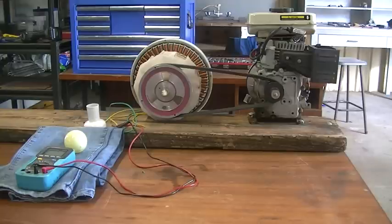This is what I've put together so far. I've just took the motor and the generator up and doing a little bit of load testing. That light bulb is only a 60 watt bulb, and we can also have a look at the voltage we're getting from our generator while it's running. At the moment the motor is running at a very low RPM and we're putting out around 250 volts per phase. Even when we load one of the phases with a light bulb the other phase doesn't drop that much. So we're going to give her a little run right now.